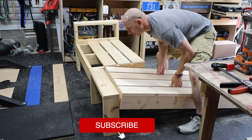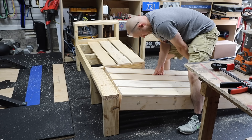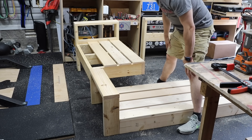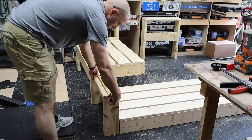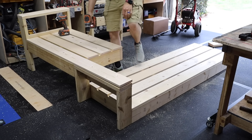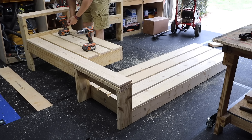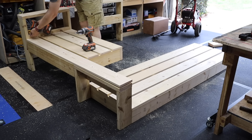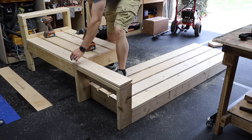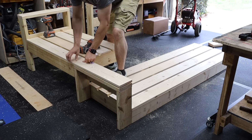You can see that this piece will actually come in there and attach underneath, and then we'll have our leg on the other end. That one by runs right across the top there — it's like 63 and three quarters. You can really see it starting to come together now. I did not glue these decking boards down because they're one bys and they may weather less well than the two by material. I want to be able to take these up and replace them if needed, but I am screwing them at two per intersection.